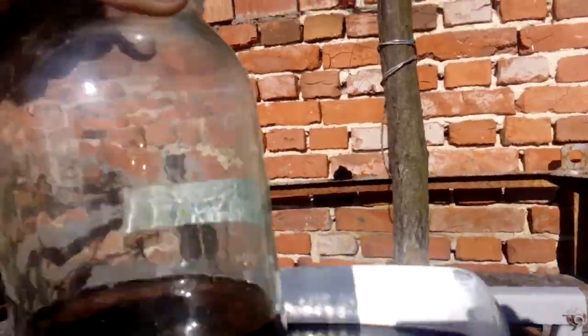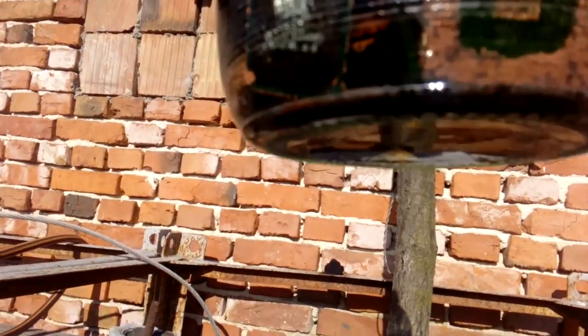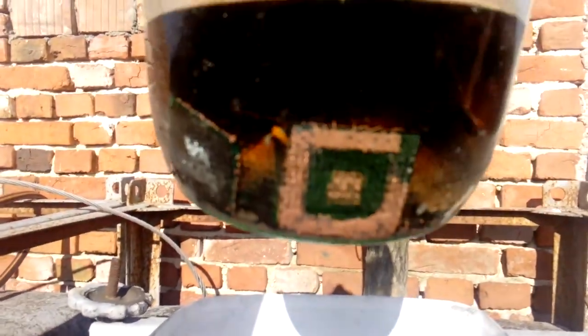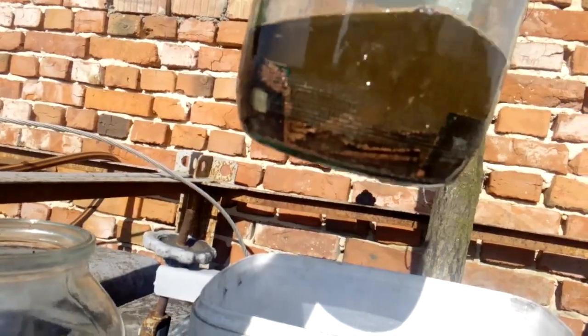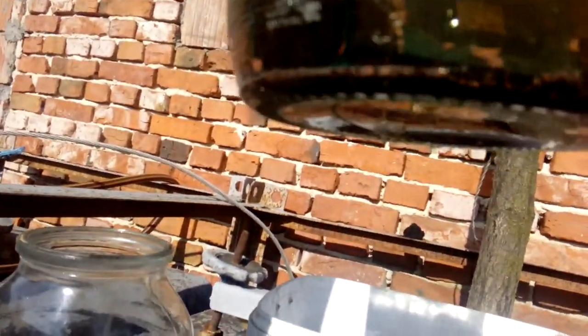Ok guys, after 2 hours you will see that the BGA chips already have some copper cementing on the tin balls. So look underneath. This is the sign that tin is changing place in the solution with copper. Just shake it — then copper goes down and you see how it changes color. Just leave it and shake it a couple of times a day, and leave it till the tin is all gone.